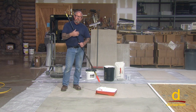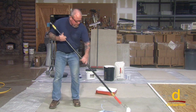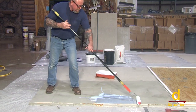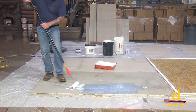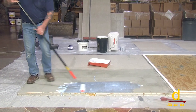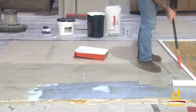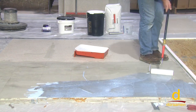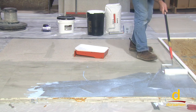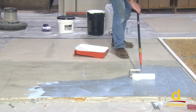The CP-1000 mixed into the SSL doesn't absorb very fast, so we want plenty of time to second trowel. On a larger application, you could put it in a pump-up sprayer and spray it down for efficiency, but it's always a good idea to back roll. You just don't want big puddles if you're spraying. It's not going to absorb as much directly over vinyl tile because it's a sealed surface. On a concrete surface using CP-1000, you definitely want to put a good amount down per the recommendations and tech data, back roll out any puddles, and then second prime it.